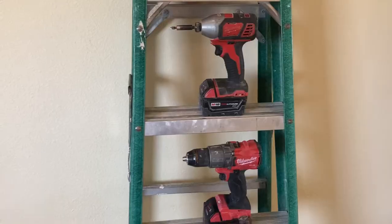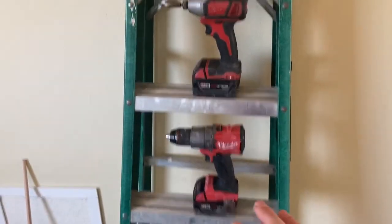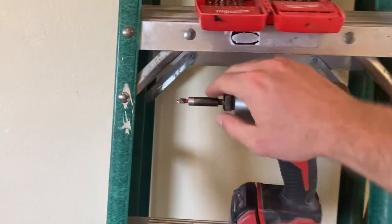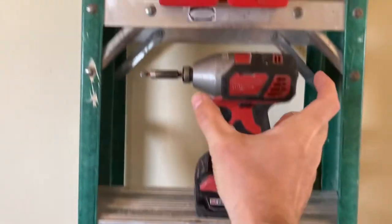For all of you who don't mind a little overtime on the video and like knowing some extra information, this is the tools segment. These are the tools of the day and I'm going to explain the differences between them. So here is an impact driver and a drill, and I'm going to show the differences real quick — not in great detail, but the advantages of each. The impact is used mostly for driving screws or lag bolts. It's really compact, so it fits in between stud spacing really easily.